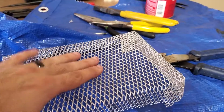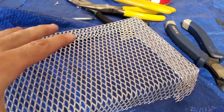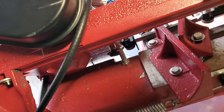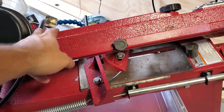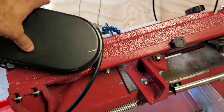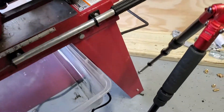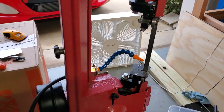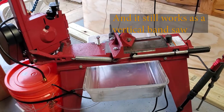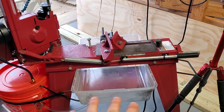Before, this thing was super easy to collapse. Now it's not — if I drop something off the saw I don't have to dig around in the water to get my stuff out. The hose doesn't get tangled in the saw path or saw motion, and this just keeps it pretty much out of the way. You do have the belts you need to access in case you want to adjust your speed, so we're not obstructing that. And you're still able to change the blade as well. It's good to go through those tests — what's your maintenance cycle going to be like? That's why we're using that bottom tray to hold this, essentially your first-stage tank or your catch.